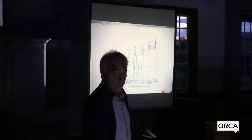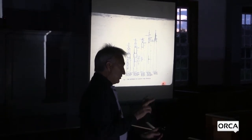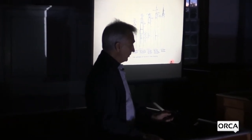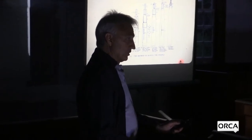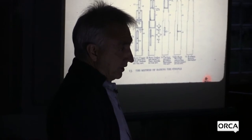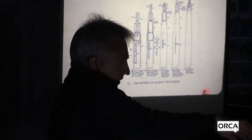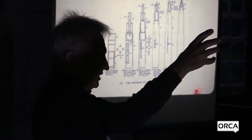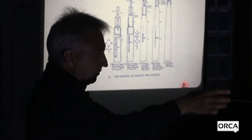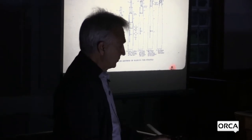It took a long time to find actual, more than conjectural evidence, but I found it in the same year, 2007, in the Stratford Townhouse, if you know that beautiful building, and the South Woodstock Community Church. At the Stratford Townhouse, I didn't pull the steeple because there's nowhere to put it; it sits on that tremendously steep hill. So I put up 67 feet of scaffolding, put I-beams through the church, jacked the top off the bottom, and then repaired stuff. In South Woodstock, we pulled the steeple, which was fantastically rotten.